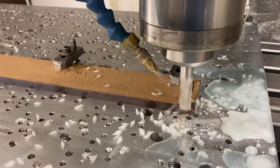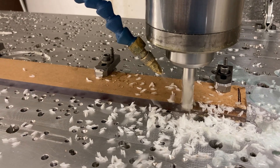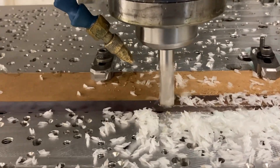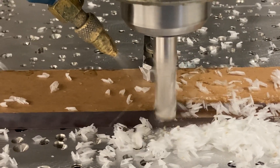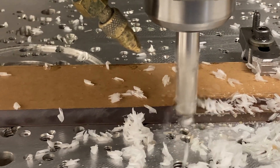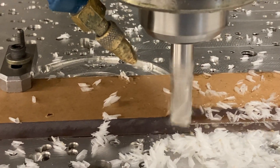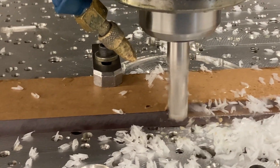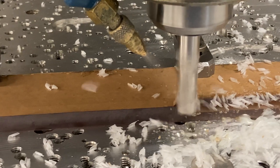It's actually not moving all that fast - 15 inches a minute is pussyfooting, but I don't want to chip the material. Plastic cuts easy, tools last forever. I'm running conservative on this stuff - this thing could really be cranking and the chips could be flying, but I'd rather have it cut nice and clean. I hate tool marks. Everything's cutting nice, leaving no tool marks or very minimal tool marks. I'm not going to set any land speed records doing this, but I can walk away the whole time it's running. I'd rather let the machine run and not worry about it.